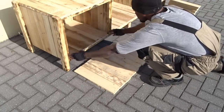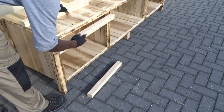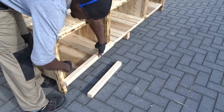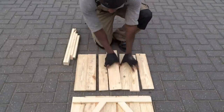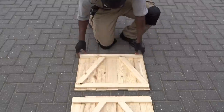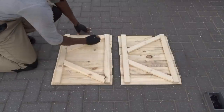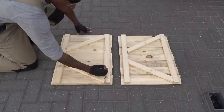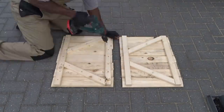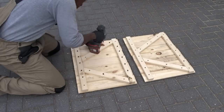Now it's time to create the doors. I will of course again be using pallets, but this time they will be screwed to two pieces of lumber. For this door design, I've made it very simple — like the old times: taking some slats of wood, joining them together, and attaching them to the main frame. That's it. To avoid breaking the wood, I'm first pre-drilling some holes, then gently adding the screws.